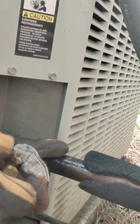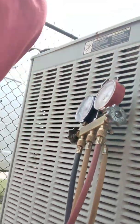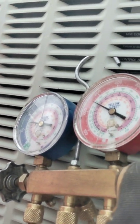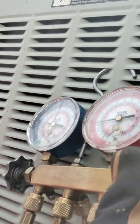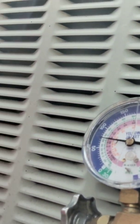I'm going to lose a little bit here. Y'all know how it is throwing off a liquid line when it's running. It's still running, so this suction pipe is sucking — that's why we took the liquid line off. Come over here to our gauges and we want to open up the liquid line, the red line. Open it up, and that lets the liquid flow into our middle charging port.